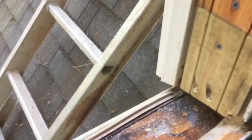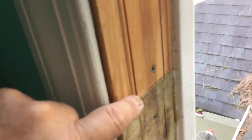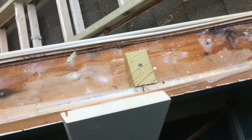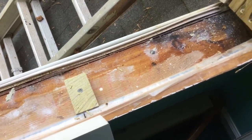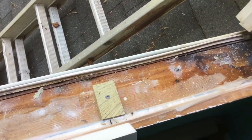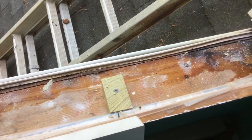Okay, so I'm back. So what I've done, I filed down that edge. I put the block behind and put a screw in, and then screwed in my side pieces on both sides. I pre-drill everything so that nothing splits. The other thing I like to do is I make a little wedge to give the sill some brace in the middle. I've tried different ways of doing that. I cut it the same angle as these, and then just cut it horizontal to fit. A lot of times it's trial and error.